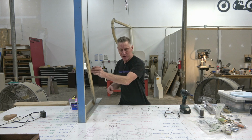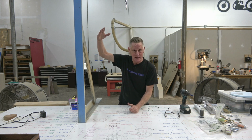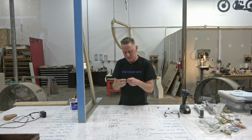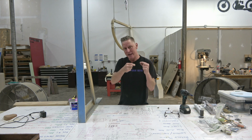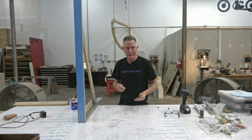The reason we use a washer on this tapered head screw is that if you drive the tapered head screw into your jack stand, all of your ribs are at 2, 4, 6 feet, and so that means you're going to have a line of perforations from this guy. And it's far better to just penetrate with the screw threads themselves and not drive the head of the screw into the wood, because if you do, your jack stand is going to fall apart in short order.